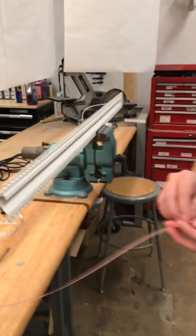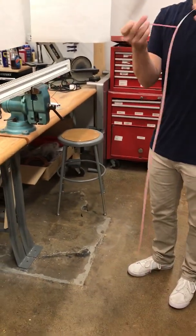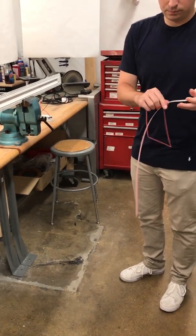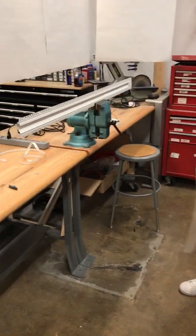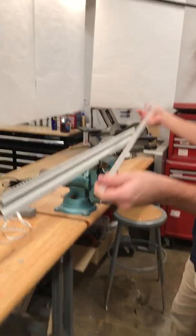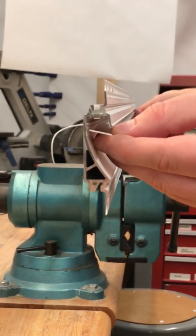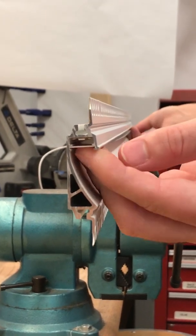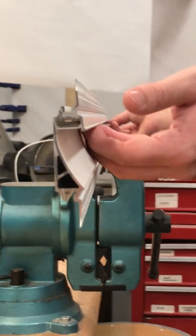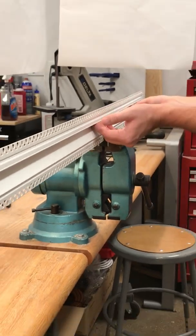And after that is in, the next step is to take your dust cover, and there's a protective backing on it. You'll want to just peel that off. And then when installing this, you want to just start at one end. You want to have it approach pretty much flush with those engagement features and just snap it through. And just go along the length, pushing up on it to snap it into place.